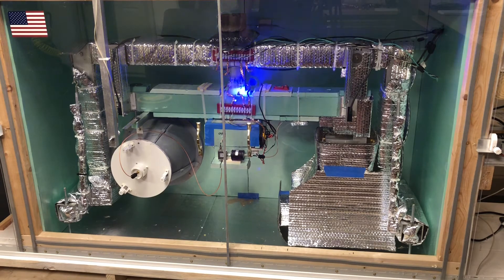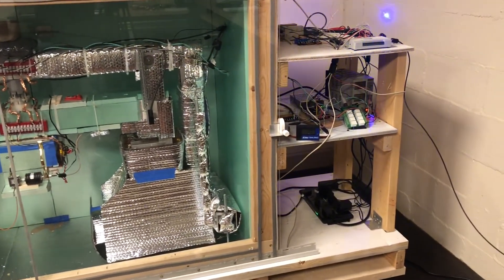Also right here you'll see the liquid metal contact system — I have eight individual liquid metal contacts, or four pairs. You can see here is the M drive itself. Measurements are taken using these laser displacement sensors; I have two of them, one there and one over there. They have a resolution of three nanometers, and the data is sent over to the ADC right here.